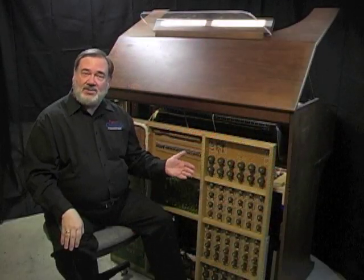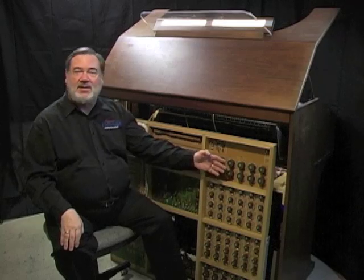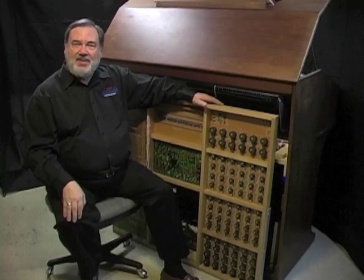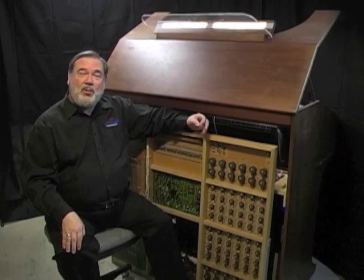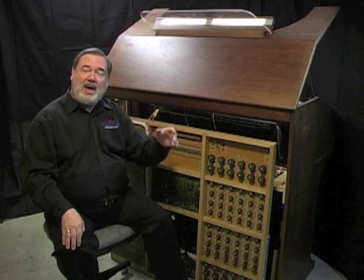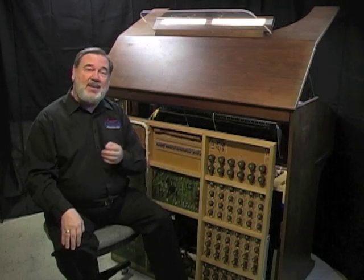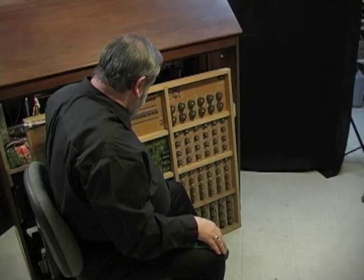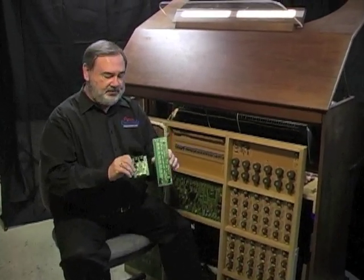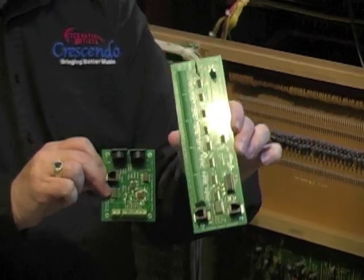As we move to the back of the Rogers Trio, those of you who have seen the inside of a Rogers organ before will recognize the ceramic oscillators and these boards. One of the first things we get to do is cut all the cables that go out to these boards. We want to be very careful when we cut the keyboard cables to cut them right up at the board and maintain all the lacing of those cables, which keeps the notes in order. All of this electronic equipment is going to be replaced by two types of boards: a micro-mini board, which is our computer board, and an input board.